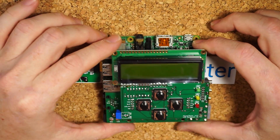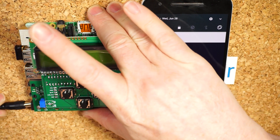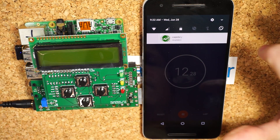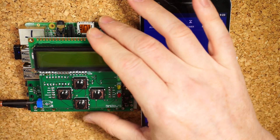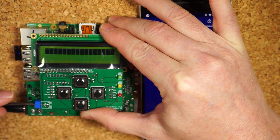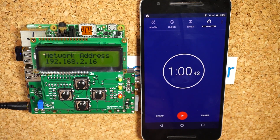I've just built this unit, so we'll see if this powers up. We're going to bring in the stopwatch and see how long it takes. We've got our 12 volts coming in and go. I check that the lights are lighting up. During this time, we're going to take our contrast potentiometer and turn it until you see all black marks, then back it off until you see the display. It takes about a minute. And bam — just under a minute to boot up, connect to the network, and be ready to go.